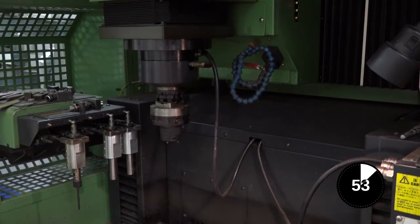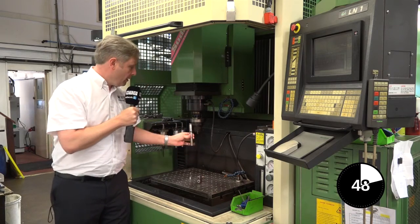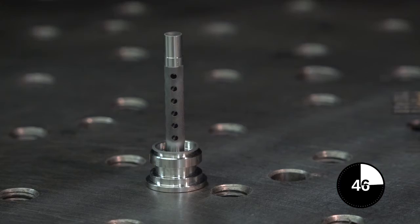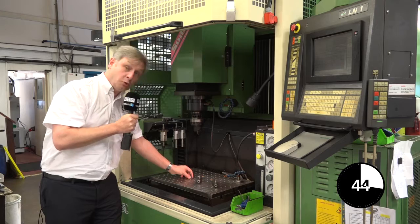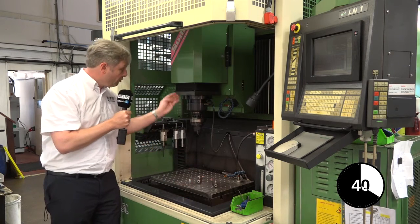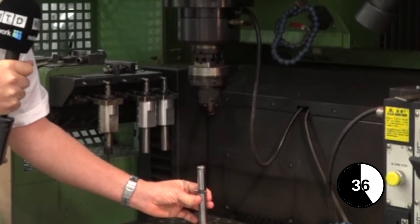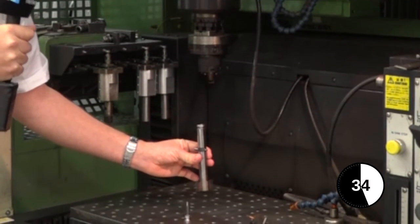Obviously having the machine here, you'll make a piece of tooling, generally bespoke, that will sit here. You have your component — this has already been manufactured — which will sit underneath it. A current will run through the tooling, it will then hit the component, spark and erode that material.